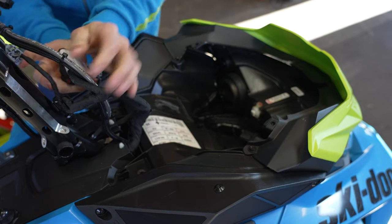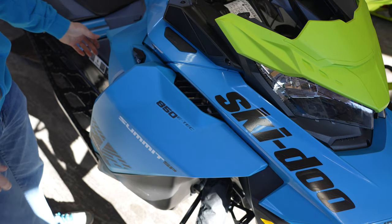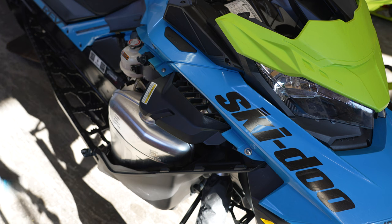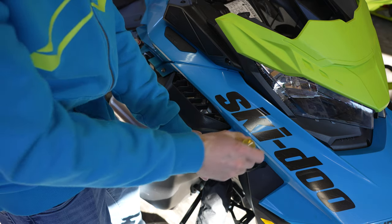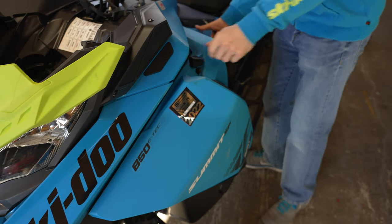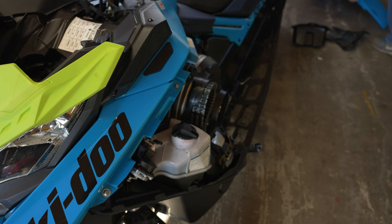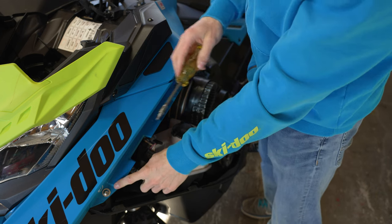So when we're pulling the entire hood assembly, make sure it's not getting caught anywhere. There's also one more bolt here we have to remove, so we'll go ahead and open our side panels — take it off completely so it'll be out of your way. This one here has a washer, so just a reminder when you're putting your hood back on, the ones with the washers are the ones underneath your side panels. Same thing on the other side — now we're doing the one on the left side. Pop your panel open, take it out. And don't get mixed up — not this one here, it's this one over here with the washer.